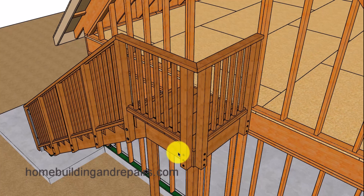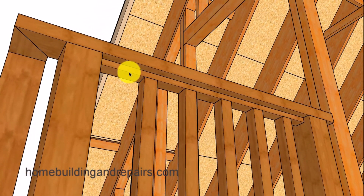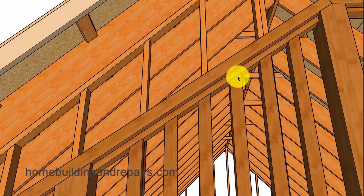You can see here where we have a post on each side with about a 1-inch gap. Under the handrail, we have a 1x2 that we can use to fasten the balusters to and at the same time fasten the 1x2 to the top railing. I've built a lot of handrails like this — it's actually a common architectural detail, along with the angled balusters connecting to the angled 1x4.